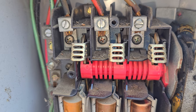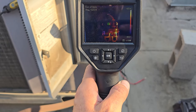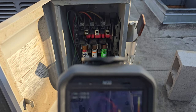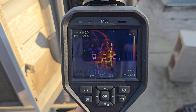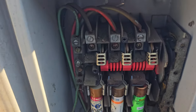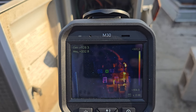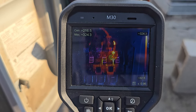I want to get a thermal imaging camera and have a look at that disconnect switch too, to see if we have bad connections. The knives are not pushing all the way back — they're barely making connection. So that disconnect probably needs work. I've got my thermal imaging camera right here and I'm looking at the number one or number three terminal — the lug. You can clearly see that that side is getting really, really hot. Number two is kind of getting hot, but number one is not hot at all. So that fuse is getting hot and it's got a bad connection.